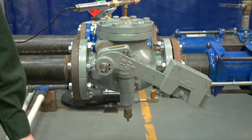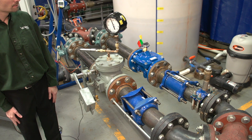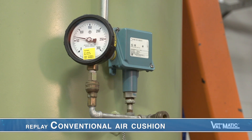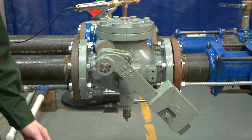We can see the valve is opening and the flow is about nine feet per second and pressure is building. And there we heard a significant slam. We just saw the pressure reach 80 psi, the pump trip and slam the check valve closed.